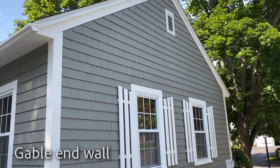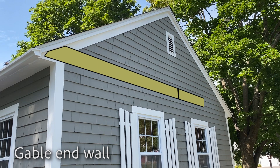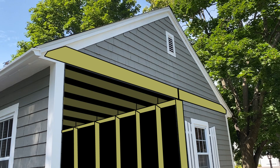Every house is built differently, but they all follow the same principles. You have outside walls on either side that the roof rafters sit on and go up to the peak, and then you have a gable end that goes up. Typically the house is longer from gable end to gable end than your outside wall to your other outside wall. Typically, joists are run along the shorter span. They sit on the top of one outside wall connected to the roof rafter and run over to the opposite outside wall with a center wall in between that supports the middle of that joist run.